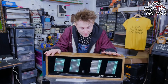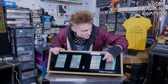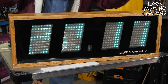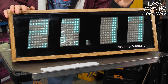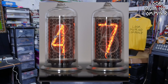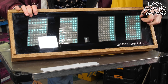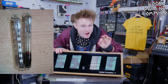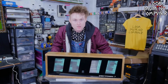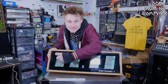The interesting thing about this is these aren't LEDs. You see these green little dots? These are actually all inside their own vacuum tubes. These are VFD Nixie tubes - an old way of making illuminated display devices, much like you see the Nixie tube high voltage clocks, as well as the VFD number digits. These are actually long and thin glass tubes called IV26s, and they've got seven dots - seven green dots in each of them.